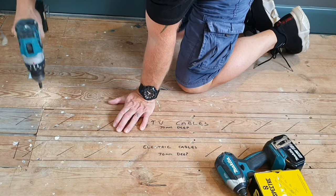So that's the floor all fixed now — I've managed to get rid of all the squeaks and creaks, especially when you come into the room. The first method is just to knock the nails in further with a centre punch and hammer, which increases the grip on the board. However that doesn't always work, so as you saw I put additional fixings in — screws that were piloted and countersunk — and that pulled the boards tight to the joist and fixed all of the squeaks in this room.